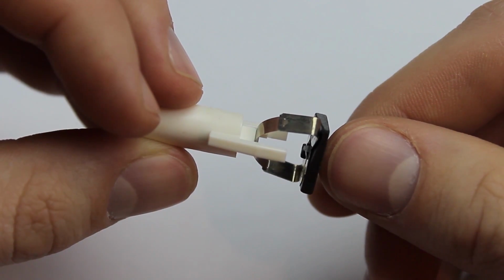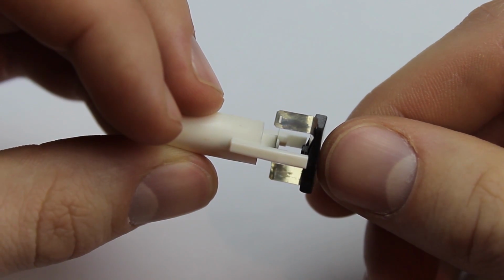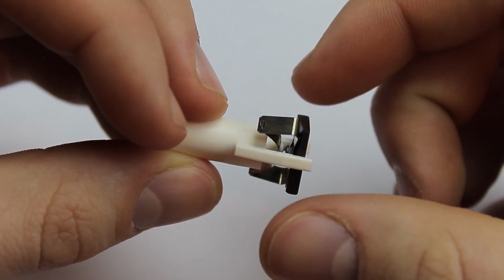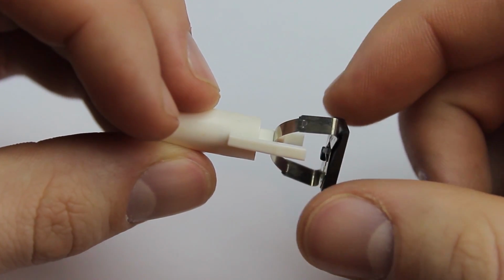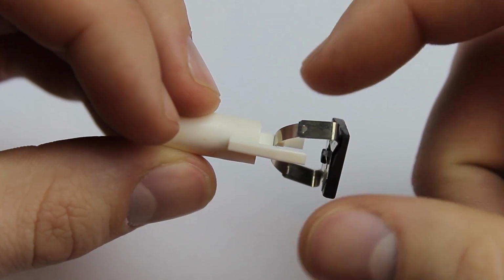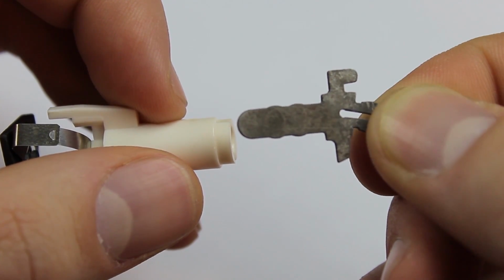The way this works is by virtue of the interlock mechanism. When you press a key down far enough, the beam spring inverts, and this causes the fly plate below to be lifted off the PCB. This spring flip is also what causes both the tactile key feel and the clicky noise of the switch. At the top, meanwhile, are several supporting elements.